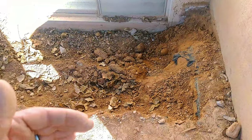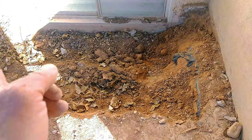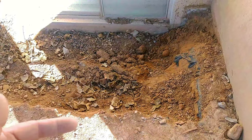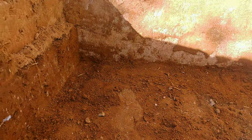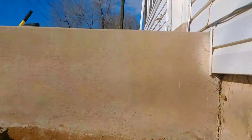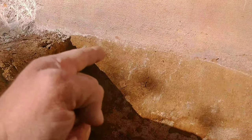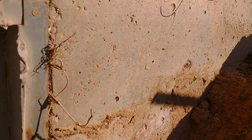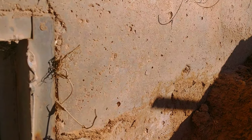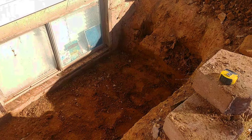Code says we need to have three feet off of the face of the basement wall for egress — these are all bedroom windows. So we're gonna go three foot and put our first form. This is all dug out. This runs into some concrete steps from the front door, so we're gonna dowel into the side of the step, and on the other side where we're returning into the wall, we're gonna dowel into the wall with some number four rebar.